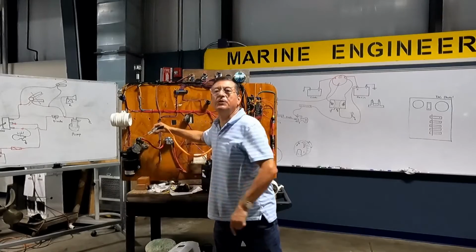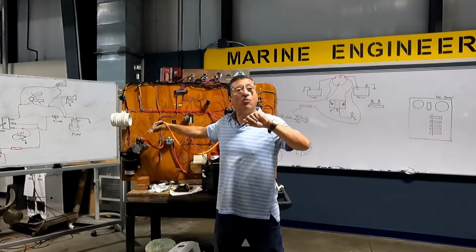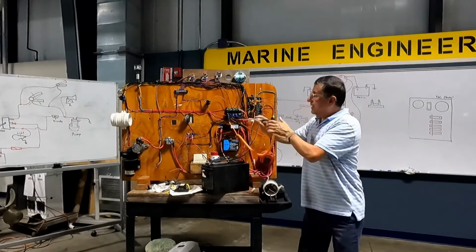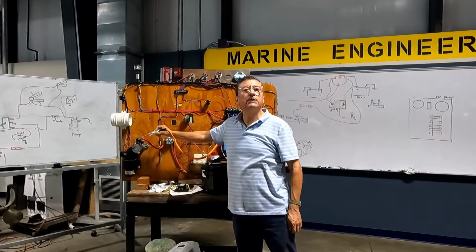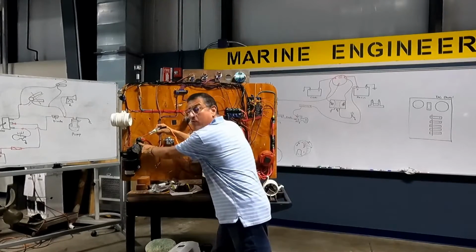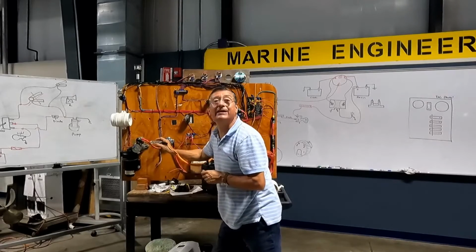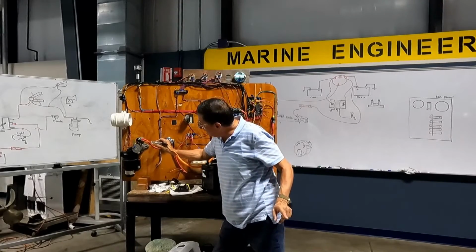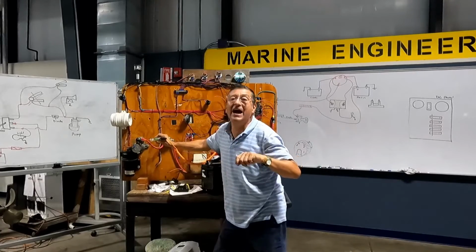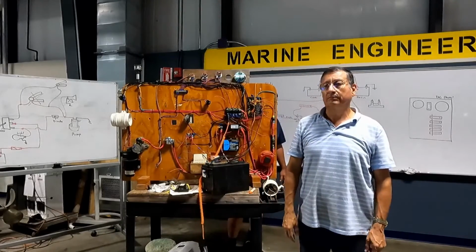How can I bring power here? In what position? The big power. In the first position or in the second one? In the first position, ignition. I have power here, and of course I have power here. Excuse me. This is basically a relay with external movement, solenoid. I have power in the second big one? No. Why not? Because I don't have the yellow red signal here. Can you activate the yellow red signal, Danny? Yes. Look at this, it's off. Danny, activate now the second position. Once again, and now I have it all right, bingo. That's the start mode.